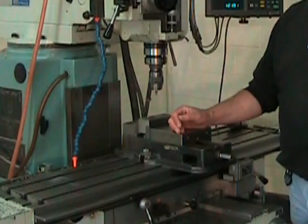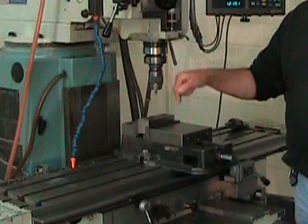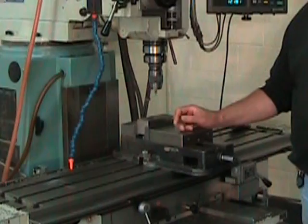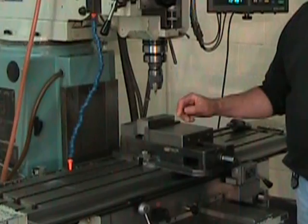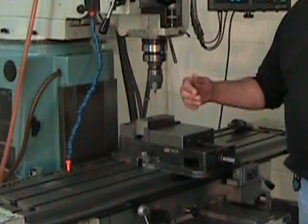That's why if I have pre-drilled holes, the center of the tool, when it plunges into the part, won't be meeting any material, and that'll really reduce the problems inherent to plunging a 2-flute end mill into a part, such as tool deflection. I will, however, be very careful not to drill the holes on the full length of the pocket, even though the bottom groove goes end to end. That's caused by the fact that the bottom groove on one of the ends undercuts a vertical surface on the other side of this part by about 5mm.